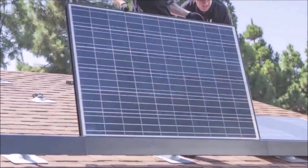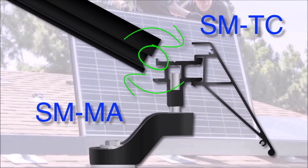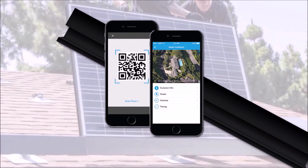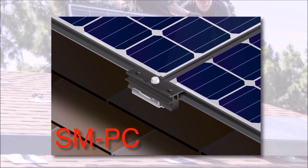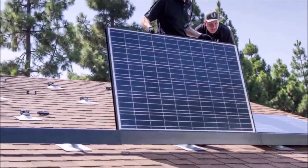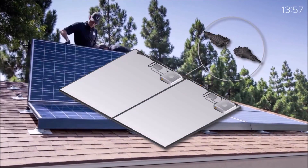Proceed to hook and lower panels into the bottom row of mounting assemblies. After scanning the QR code into the customer's site for the SunMax mobile app, insert mounting assemblies and panel connectors along the top side of the panel to stabilize and bond adjacent panels throughout the array. On rare occasions, connector mounts substitute panel connectors in the event that a mounting assembly coincides with the spot of a panel connector.